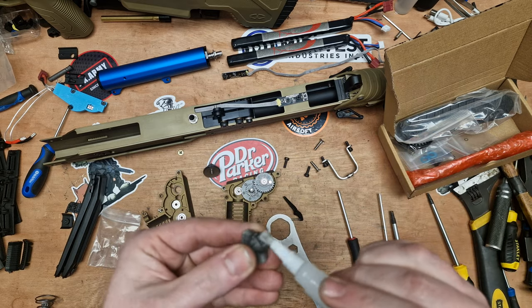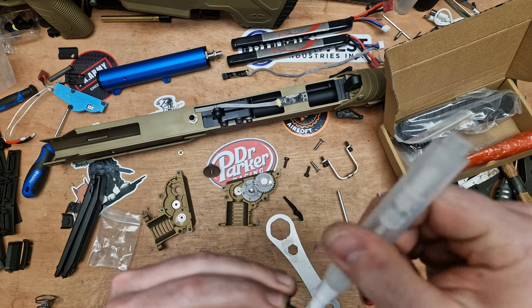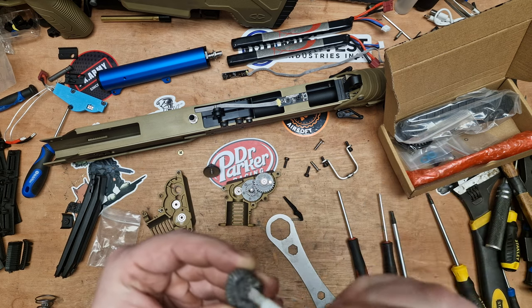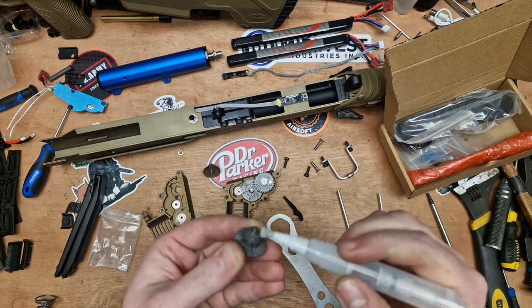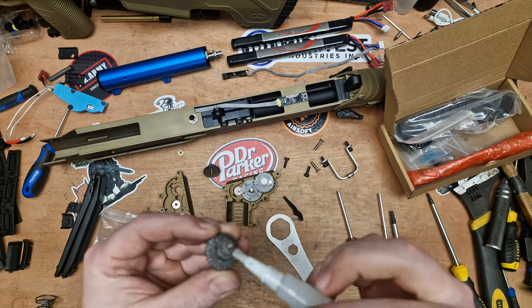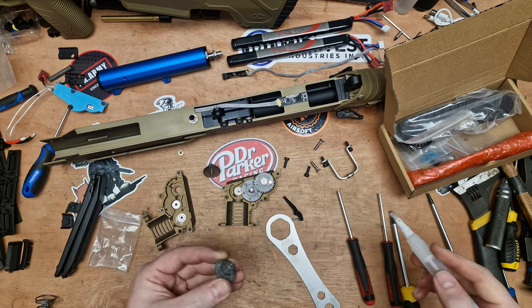I'll ship him that old gear as well as a spare in case he needs it. You can pull out the gear. One thing I thought was really weird: in Silverback's video for fitting this gear, they're using really sharp tweezers to apply the grease. We don't need that when we've got the Jager 1 grease pen - you don't need tweezers to apply it. We're just going to pre-grease this a little bit. This is the reason they're in this pen - it just makes it super easy. We're not over-applying it; we can brush it in.